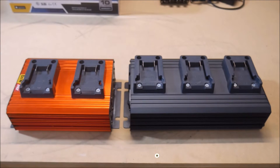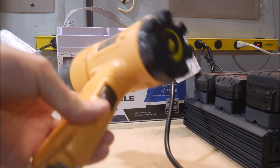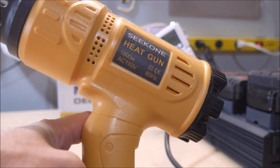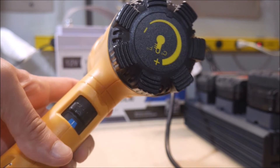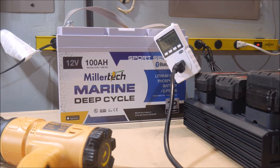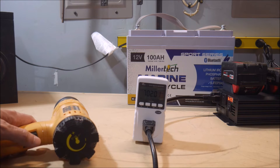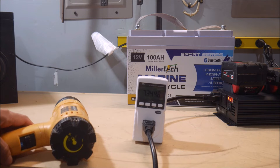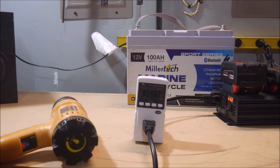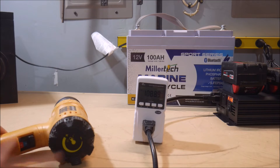It's covered by a one-year full warranty from Millertech. So before you think this is just a commercial, let's do some real-world testing. One of the devices that the 600 watt unit has trouble with is a heat gun. Let's see if this inverter can run a heat gun even on a lower setting. I tried this with just a single battery and all three batteries installed, and it didn't change. The heat gun could run on low at about 600 watts for an extended period of time with no issues. I was also able to run the heat gun on high with three batteries installed, and it didn't complain, even at 1,200 watts for short periods of time. Obviously you can't do this very long, but the 600 watt model wouldn't run a heat gun at all, so this is good news.